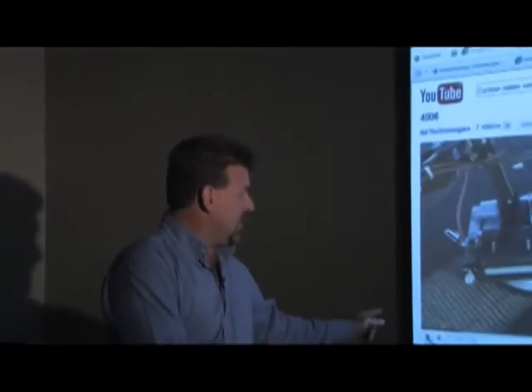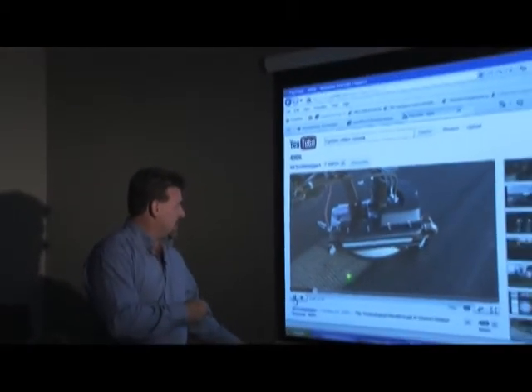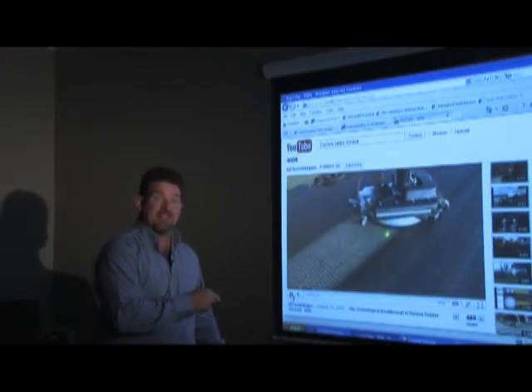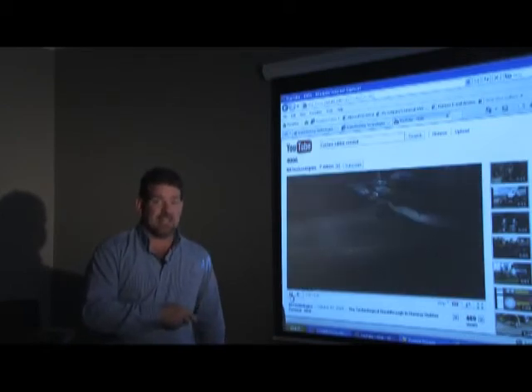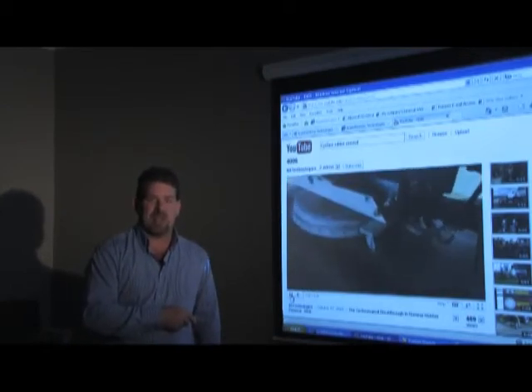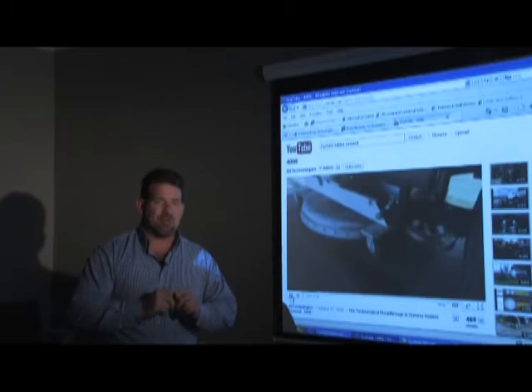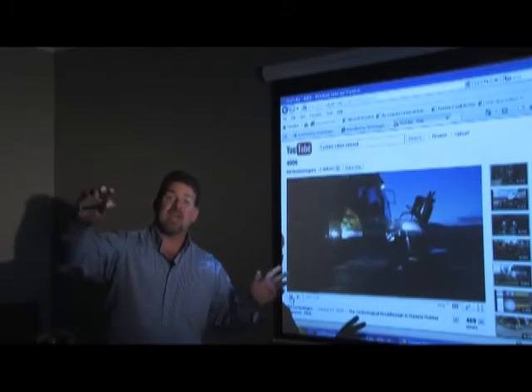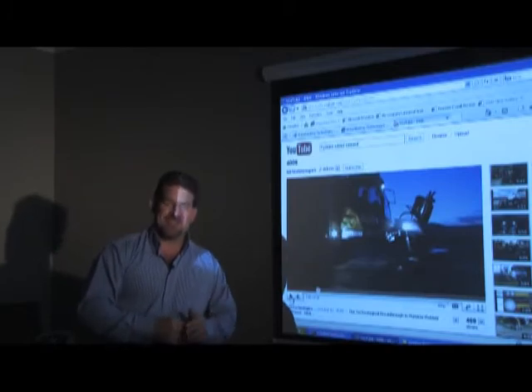While the StripeHog cleans 1,800 square meters per hour consistently, go on YouTube and watch the Cyclone work. You can see right here it's going to the tune of about 30 grooves every six seconds. If you work that out, that's less than 800 square meters per hour. Why? Back to the horsepower and capacity issue: 12 gallons a minute on a StripeHog and 7 gallons a minute on a Cyclone machine.